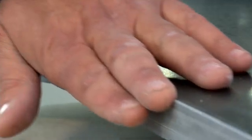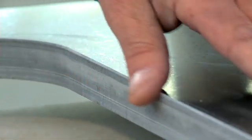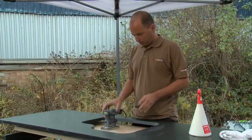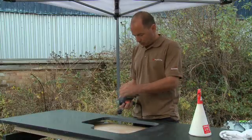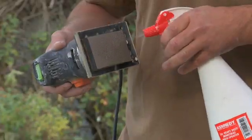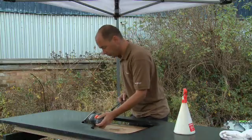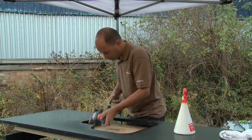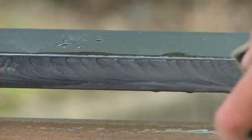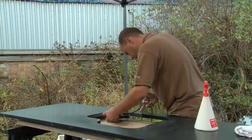The final stage is carried out using diamond hand pads from the installation pack. They're Velcro-backed to attach to handheld palm sanders, a useful method for speeding up finishing on long straight sections, but corners will require hand sanding for best results. Always keep the pad and edge moist with a spray bottle through finishing. Finish with a 220 grit pad and then a 400, using long straight strokes followed by a circular action. A 120 grit pad has been supplied to remove bumps or irregularities first if needed.